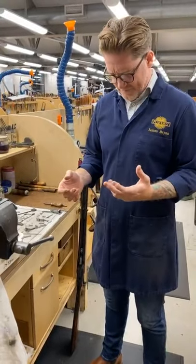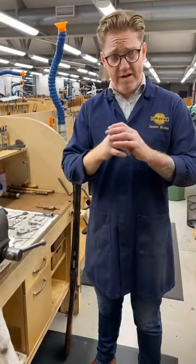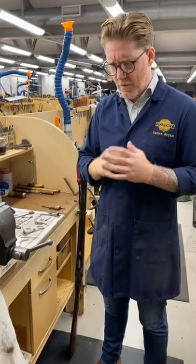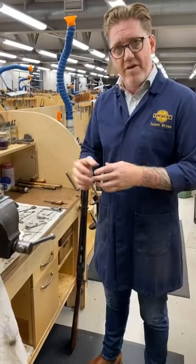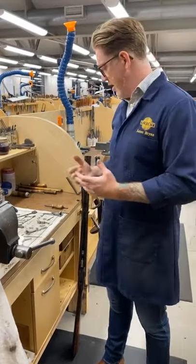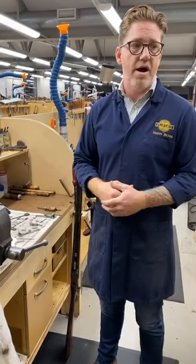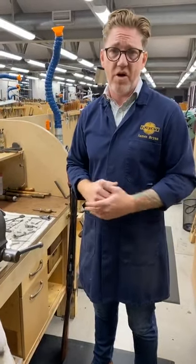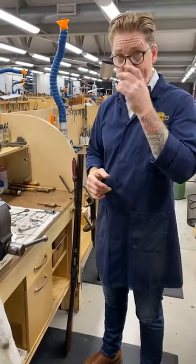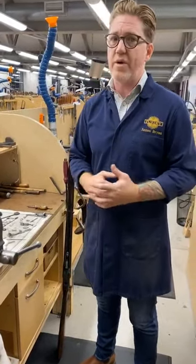So you have to have them tempered in a different way. They're not just tempered all over. So they'll be soft in areas and they'll be harder in other areas. So the run of the cam will be harder and it'll be better to work with the surface of the bottom leg of the mainspring, in order to keep the timing. When we build stuff and it's all done soft, hardened, timing can run out so easily.